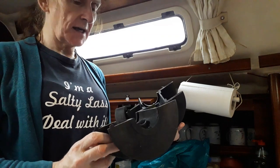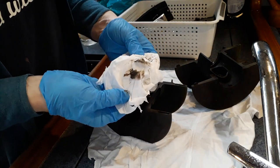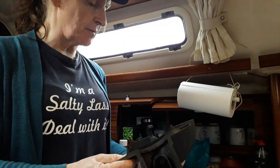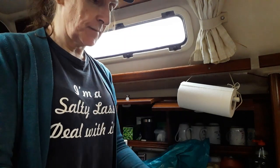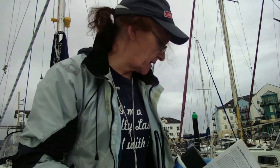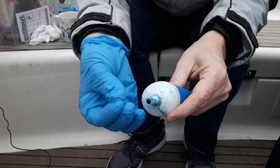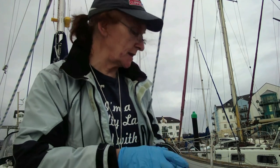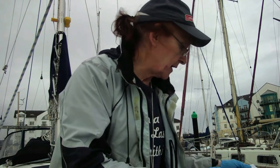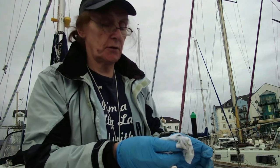I've brought the bits and bobs down and as you can see they're not too bad — we've got a wee bit of grease on them all. What I'm going to do is clean them up and then oil the bearings with some Selden grease and then put it all back together again. Last year's grease isn't looking particularly brilliant, so I've got the maintenance manual and what I've got to do is squeeze some Furlex grease — which has a rather pleasing dark blue colour — into three or four bearings. Before I do that I'll use an oily rag to wipe the bearing surfaces clean and then put new grease in.